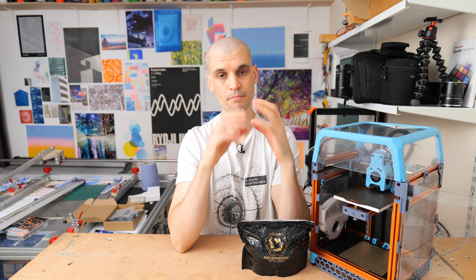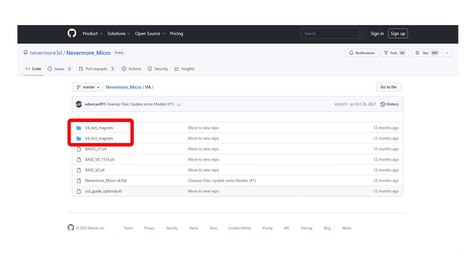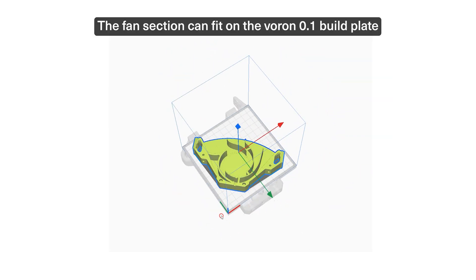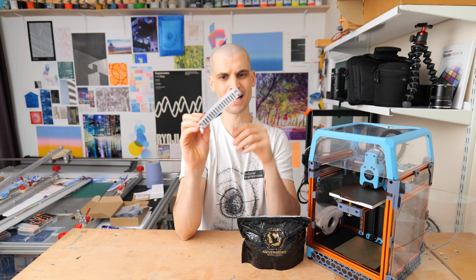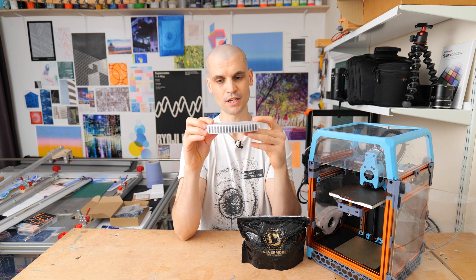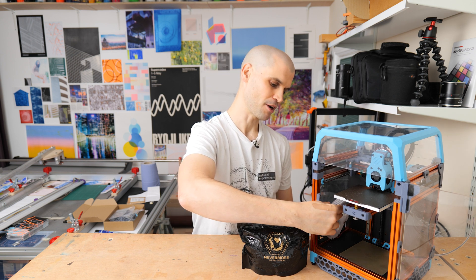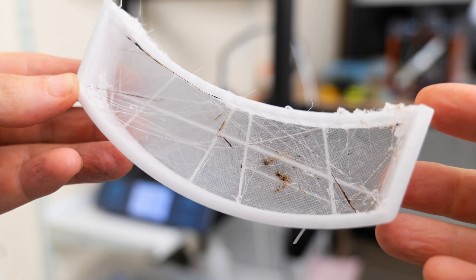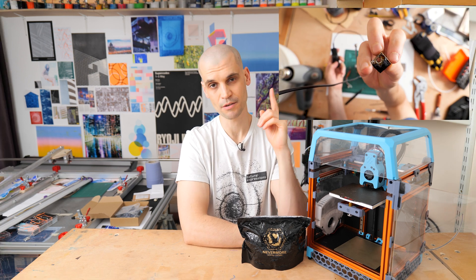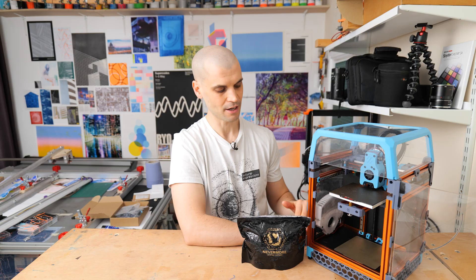To print the parts, you have two magnet size options: 6x3 or 8x4. I got 6x3 cheap ones from Amazon. Unfortunately the parts don't fit on the Voron 0.1's bed - I've seen people print them at a 45-degree angle but with all the tiny lines and retractions I ended up printing on my i3 Mega in PETG. The print quality wasn't great - I was getting blobs and burnt filament incorporated into the prints. It turned out I had an oozing problem with my i3 Mega hotend which I fixed in a previous video. The mounting brackets I printed in ABS on the Voron since they are smaller.